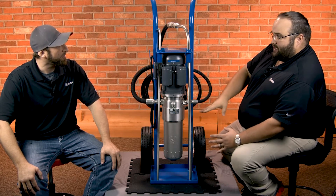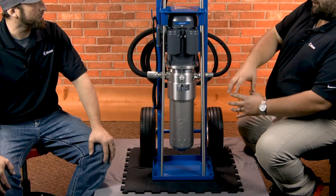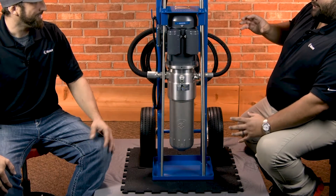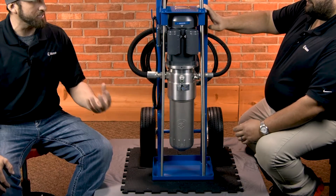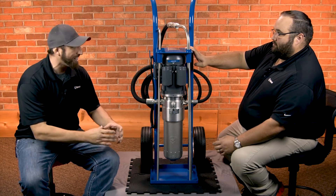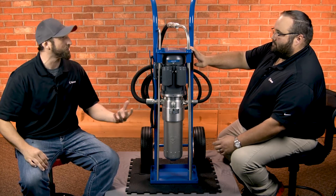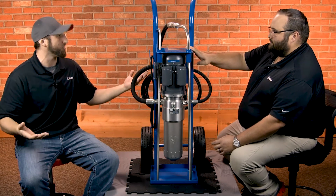What I like about these guys is that they've specially designed the cartridge to make it a lot easier and a better full changeout — cleaner. As this goes into bypass, the particulates are stuck in the end cap of the filter. So as you pull that filter out, it pulls the particulates with it. They're not stuck down on the bottom so that when you put a new filter on, all those particulates get sucked into your new filter and it clogs faster.